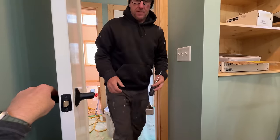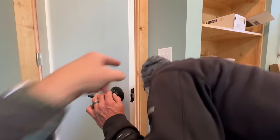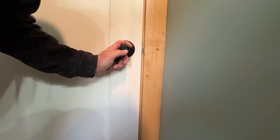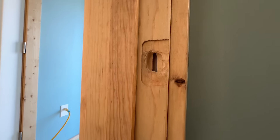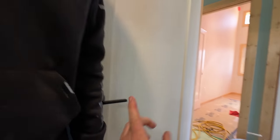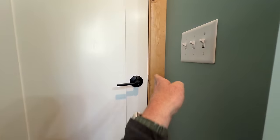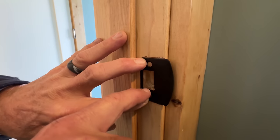If you come in here that way, you know if you need to adjust that plate up or down — just a fuzz, there's usually a little wiggle room — or in and out. You're hitting low. Who drilled that hole? It looks like it was done with a router. We need to chisel out the hole a little lower so you're sure that that catches in the hole. Then shut it and see how much wiggle room you have in and out to know how far in to slide that thing.